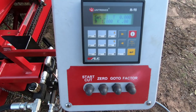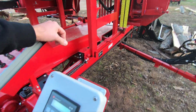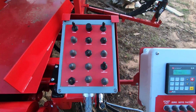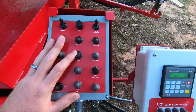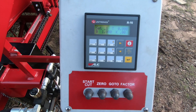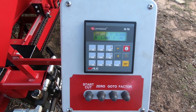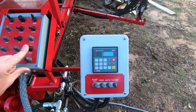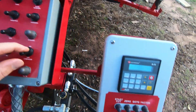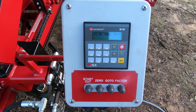In our computer setworks, power is pulled from the key switch on the engine, so I do have that switch turned on now. I cannot forget to leave this on — when I turn the key off on the engine, I lose power. It's not going to drain my battery. On my remote box, which has all my head controls on it, there is an on/off switch where I can turn the computer off. It is a very useful tool, very helpful, very beneficial — but it is not necessary to sawing. If I do not want to use the computer, I'll turn it off and I can saw manually using my scales with our fast and slow switch on the remote box.